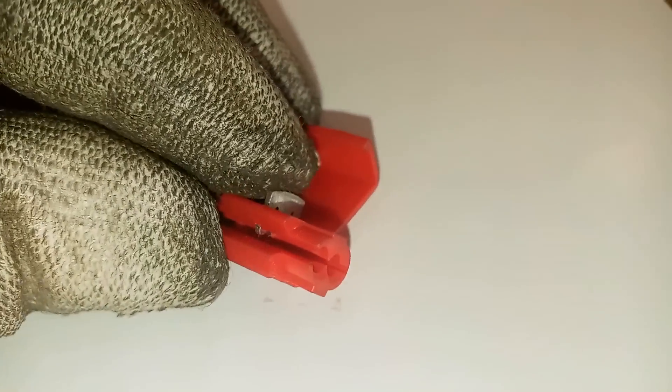Which gets us back to this. The way a Scotch Lock works is actually extremely simple. There are two barrels — the open one on this side, you slide it over the current wire, then you run your new wire into the other one. You then take a pair of pliers, or a hammer, or a rock — if you're doing this, you could probably use a rock since you probably don't have any tools. You simply pinch it down and it has two blades — literally blades. It cuts through the insulation, which is why it's called an insulation displacement connector. It then electrically connects the two wires because this thing that looks like a paperclip cuts into both pieces of wire.